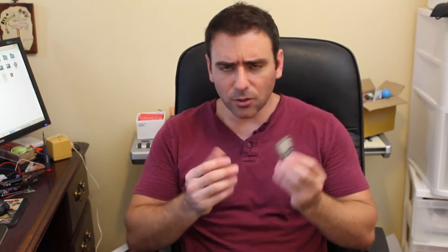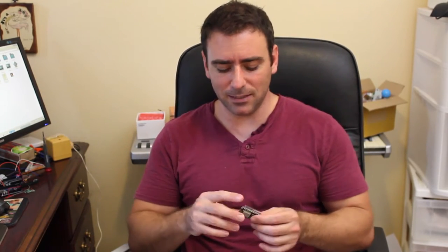If I want to make changes, I shouldn't ever have to unhook the ESP8266—no need to disconnect the button, cut power, bring it inside, and re-upload code. The ESP can supposedly do over-the-air updates, but that can get messy and there's no need for it. All it does is send one HTTP request when the button is pressed.